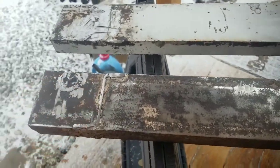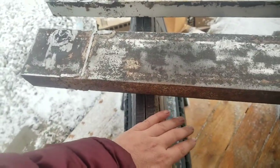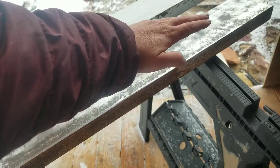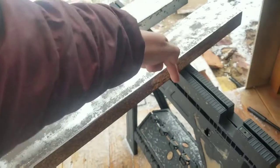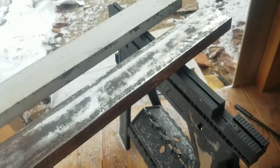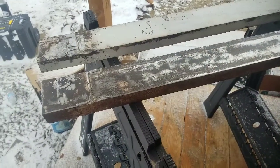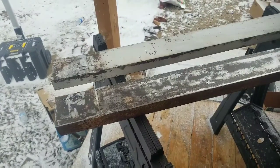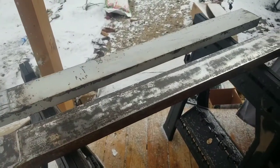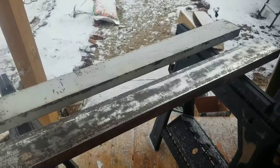So, if the rake were going right here across, I guess if this were the rake, then the wheel arm would be coming out about 40 inches, and then I'm going to have a bar go down that adjusts to a caster wheel. It's going to be really simple and way cheaper to build one myself, believe it or not, than it is to buy them. They're at least $250 before shipping online. Shipping is probably at least 50 bucks, so they're a pretty penny. Hopefully I can do better.